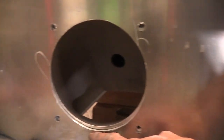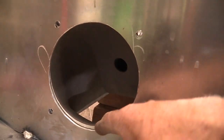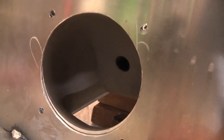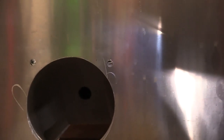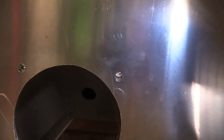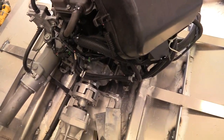On both sides there's about a half inch — it won't have as much of a seal. I thought about possibly using some filler metal, just building up a weld along the bottom and grinding it flush to give myself a little extra metal. Otherwise the hole will be oblong on top. I'll need to cut on the top and the bolt holes are going to have to be elongated — not a big deal, there's plenty of metal on both sides to seal that. This is the suction side, before the impellers, so it's all low pressure. That's kind of how this section is going.